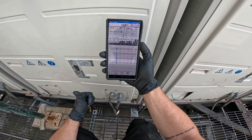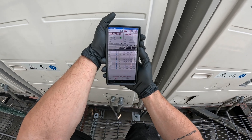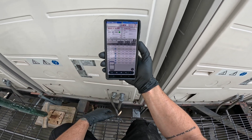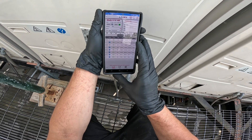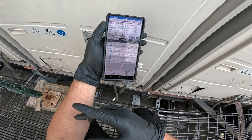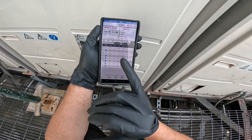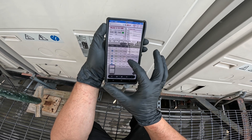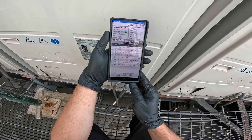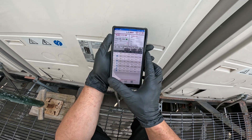Last time, this thing was like at 100 degrees, and there's just no way that room was 100 degrees. So let's go ahead and change that sensor. Our thermistors — there are three of them in the unit. We have the air, pipe in, and pipe out. Pipe in is 48 degrees, pipe out is 60, but the air at this moment is saying it's at 87.49 degrees. Pretty strange. The resistance on the sensor changes based on temperature, and I think it's bugging out.